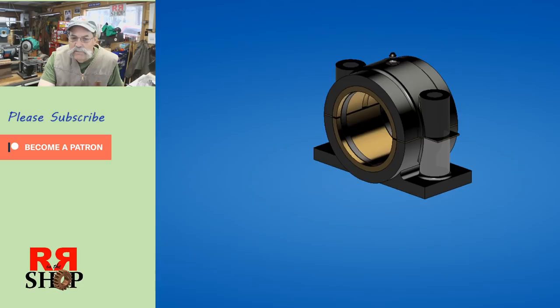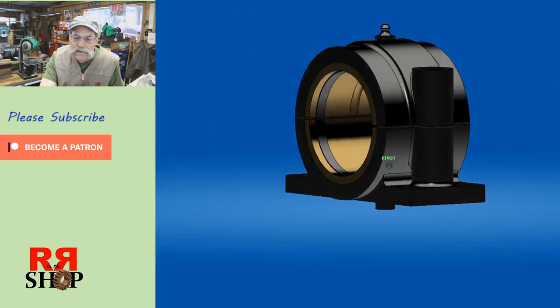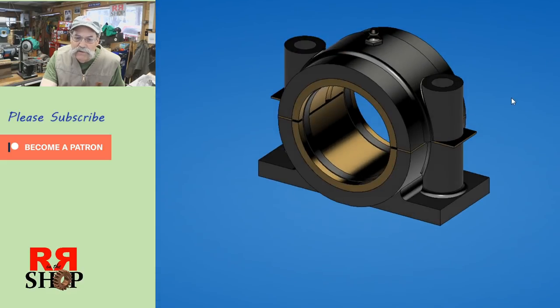Anyway, let's look at the Fusion part of it right here. I modeled the entire shell to figure this out, because these are castings and they were just ground on as far as cleaning them up. They didn't do a very good job. One thing I'm going to do is clean up the bottom so it's fairly flat, and I'll be cleaning up the top half of the bearing shells.